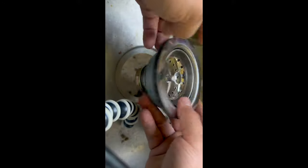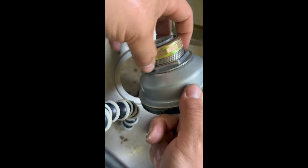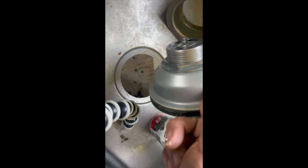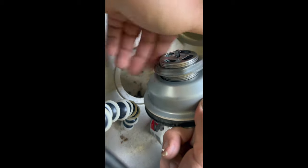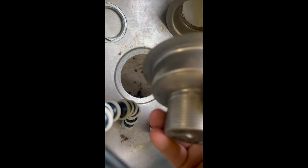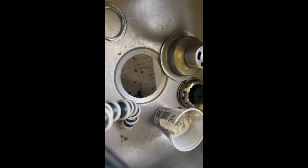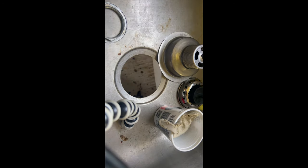Okay, we're back. We've got the new basket strainer — this is what it looks like. I like to use the ones that have the smaller nut on them so you can tighten them with just a normal pair of channel locks. Take that off, we don't need it. Take this off because it goes down below in the bottom of the kitchen sink. This is the only part we need up top — everything else can go down in the bottom of the kitchen cabinet. Now we are going to roll ourselves up a plumber's putty snake to go all the way around in this basket strainer.